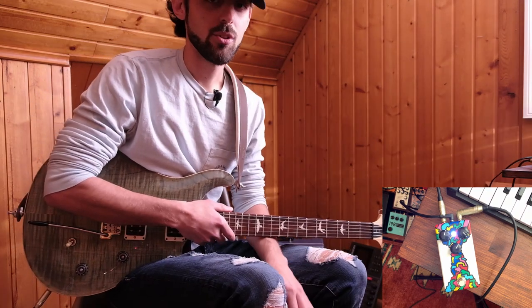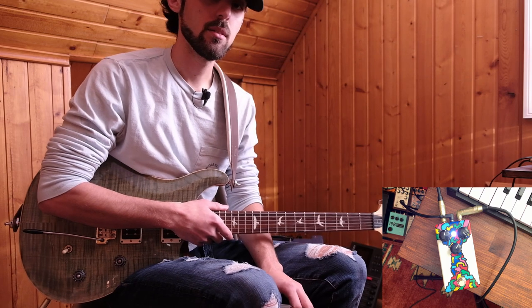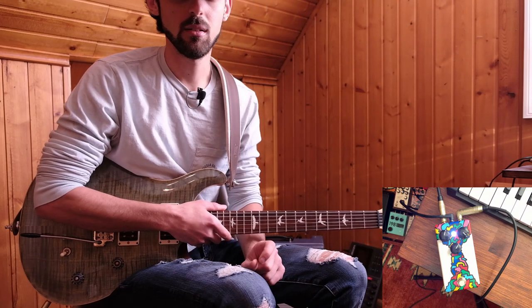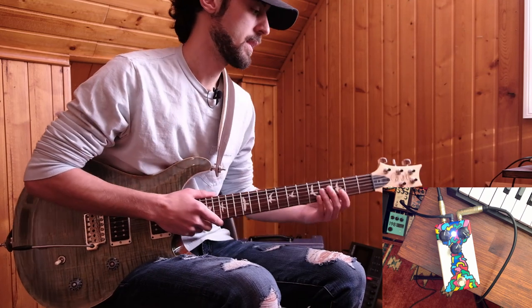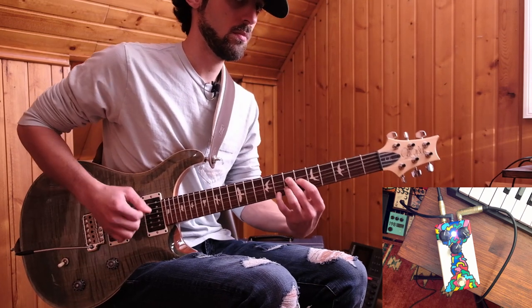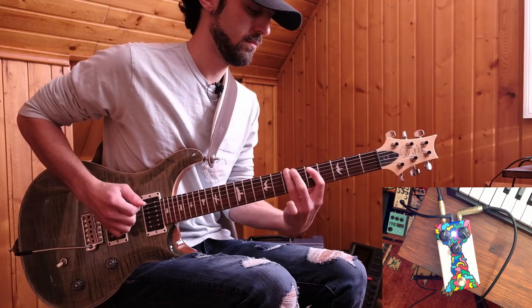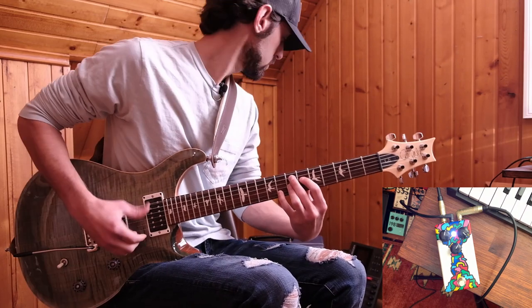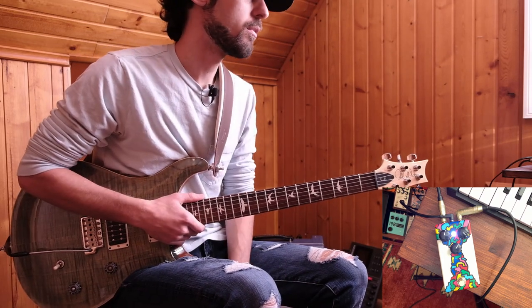So there are two internal dials as well to keep in mind with this pedal and this kit, an internal trim for the bias, the voltage bias of the pedal and the transistors and the clean signals. You can blend some clean signal in to really articulate the clarity and the individual notes that you're playing. Huge sounding, really great, kind of well-known fuzz tones.